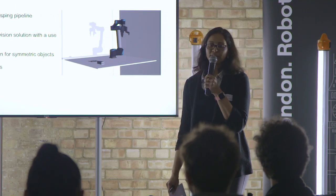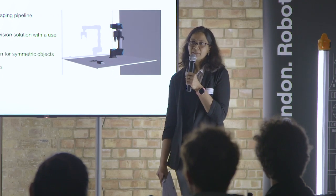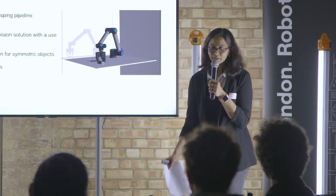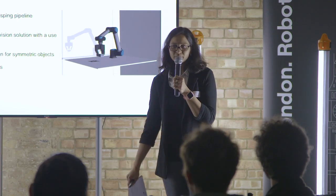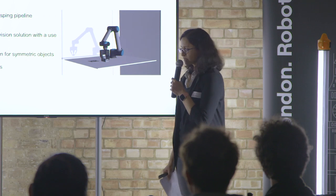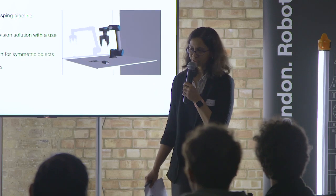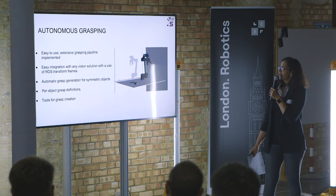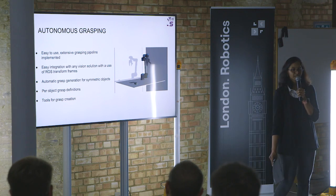But essentially in that project, the idea was to chop up an alpha contaminated glove box into small pieces and, using the Shadow Robot hand, pick up those pieces and pack them away in smaller containers so that they can be stored away as intermediate level waste or low level waste. So this is one of the use cases that Sellafield, the nuclear end user in the UK, is trying to solve in the nuclear decommissioning side of things. And this is something we demonstrated in the feasibility study in simulation.